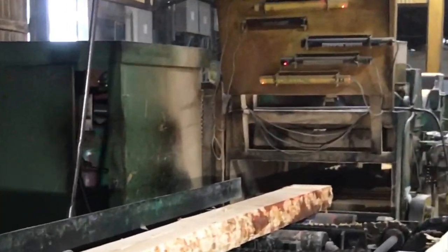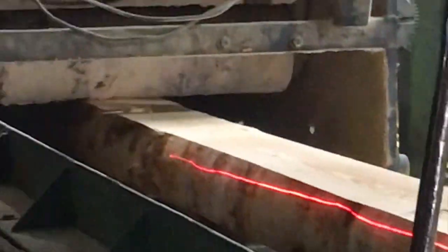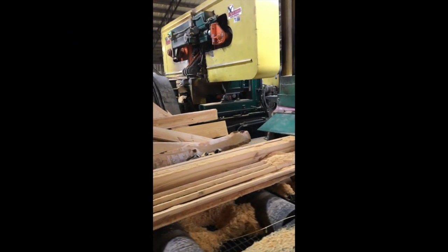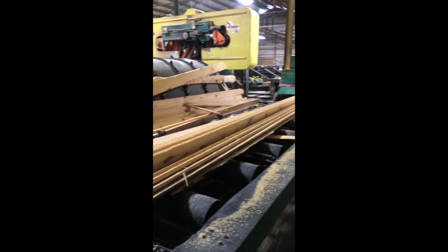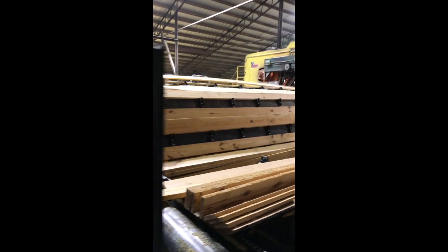For the low-grade logs, we only remove two sides of the log and then dump it to this machine known as a gang saw. It's just a bank of saws spaced out for one inch, two inch, and there's even a six inch configuration that can make a six-by-six for posts for fencing, barns, or deck materials. Lumber through this machine mainly goes to wood treaters for decking material and construction materials such as home building.